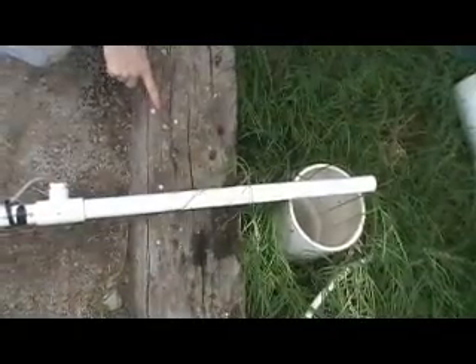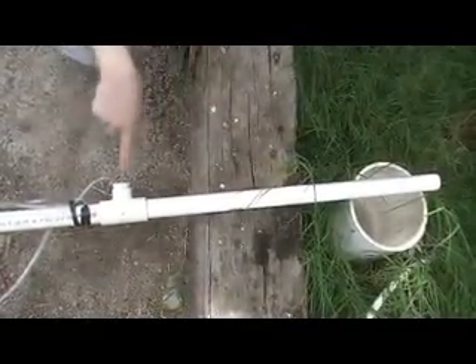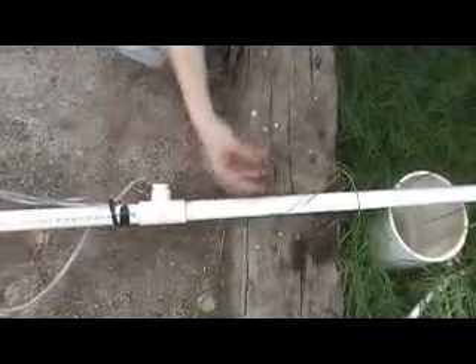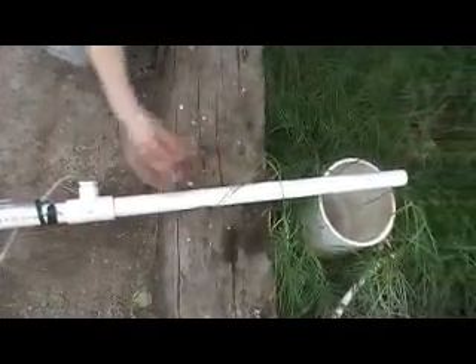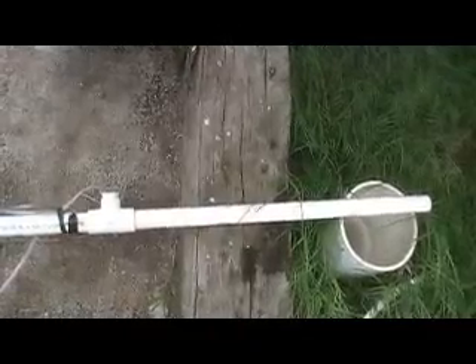We have about a two-foot length of pickup pipe. Because if you have too many air bubbles coming out at once and not enough can go up, they might go down first and we'd lose bubbles out the pipe. This way the bubbles stay contained within the pipe and add pressure in the upward direction.